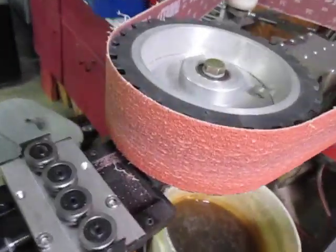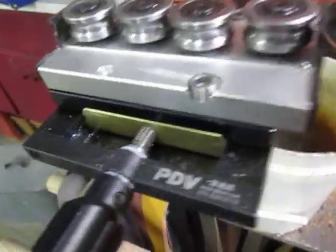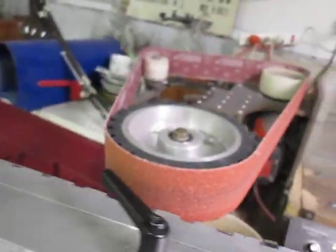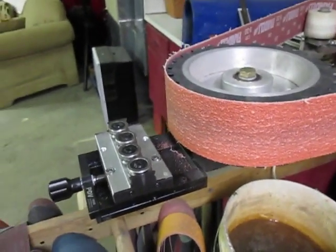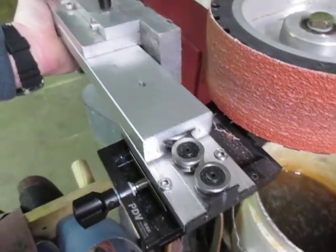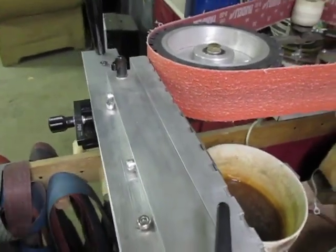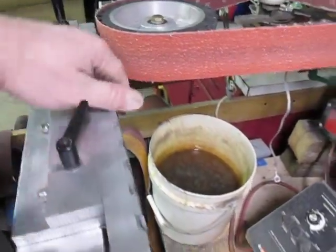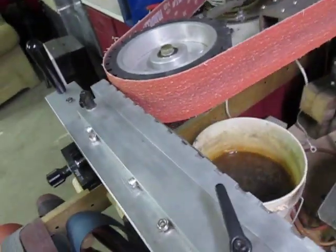The base is attached to a compound sliding table with a knob and a threaded screw that lets you advance the piece toward or away from your belt. You take a pass, move it closer, take a pass, move it closer, until the whole thing is the thickness you want. I'll put links in the description for where I got these parts — sourcing the rail was really the groundbreaker that got us all started. You go back and forth making contact with the belt, advance it forward, and repeat until you get it perfectly flat.